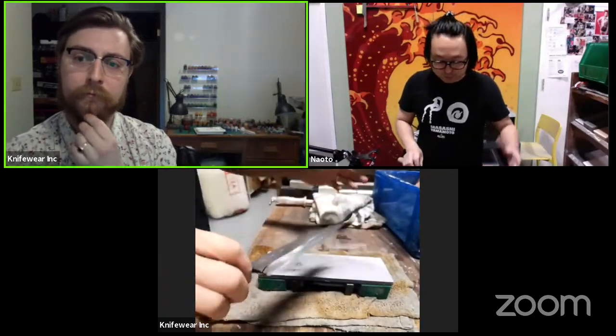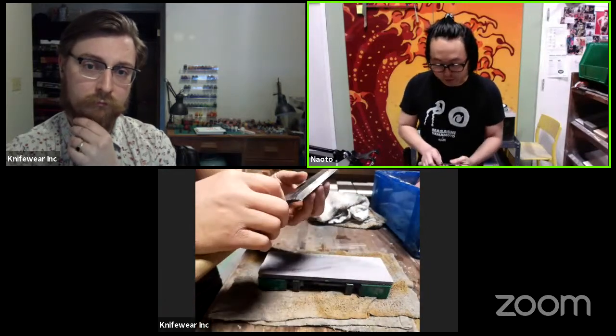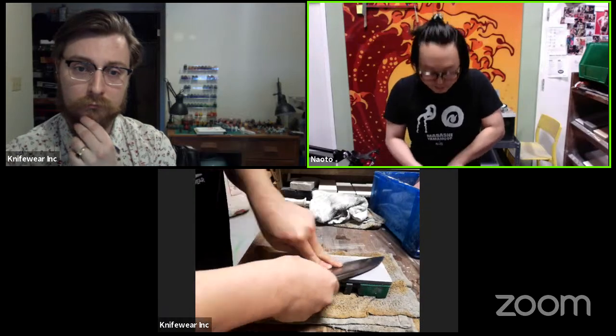All right. And what are you doing now? So since I checked the edge, I moved down. That was actually 3,000. I moved down to Shapton 220 grit to do actual sharpening. So as I was doing very similar, put the pressure down at the edge, then a little bit upper here.